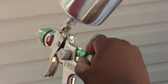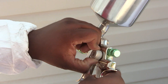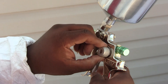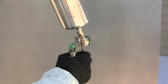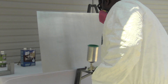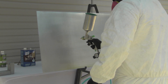Material volume adjustment: turning the material adjustment knob clockwise closes the valve to prevent fluid needle movement and stops flow of liquid from the cup into the gun. Fan adjustment: this control, which is sometimes on the side or back of the gun body, adjusts how much the spray stream is flattened into an oval shape. With the fan control fully off or turned clockwise, the spray stream will create a round spot. Turn the fan adjustment counterclockwise about halfway open. If the fan width is set too small, it will take more side-to-side passes to cover the substrate being sprayed, and it is easy to apply too much liquid and have problems with pooling, which yields poor results. The fan spray pattern can usually be adjusted from vertical to horizontal or any angle in between — simply loosen the air cap and rotate the nozzle. It is typical to leave the spray pattern at vertical, in which case the gun is moved in a horizontal pattern.